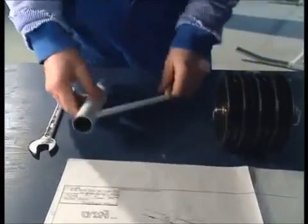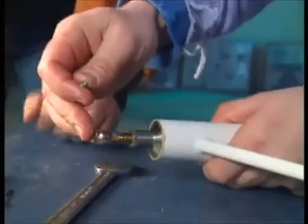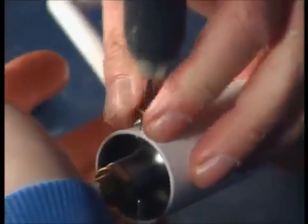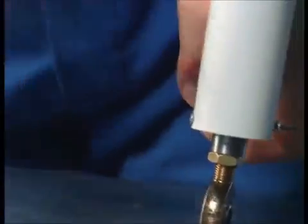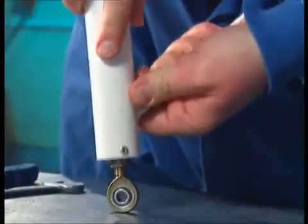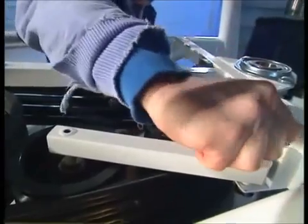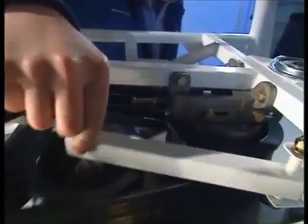Next up is preparing the clutch tube weldment — we've got some springs to go in there. This will slide in there like that. Can you just drop that rivet in? Just use the base of your thumb. Sorted. There you can see it just acts as a stop — a back stop for the piston. The piston is free to move up and down like that. That's the pulley and its arm attached, so it can swing there and engage the pulley onto the belt.